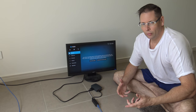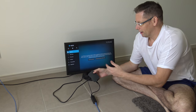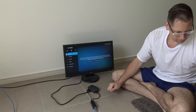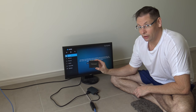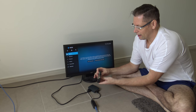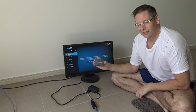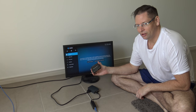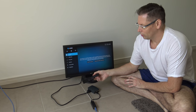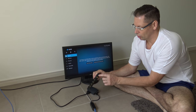For the actual media player I'm going to use a Raspberry Pi. Here it is in its most basic form. I need to get audio out of this, so I'm going to use an HDMI to audio converter — HDMI in, HDMI out, and also optical audio out. The problem with the basic version is it's a bit finicky; sometimes you get a picture, sometimes you don't. So I've got a four-port switching one which works — same deal: input, output, and you also get the audio out.